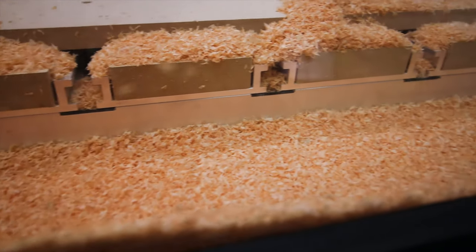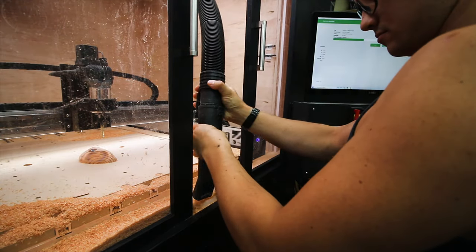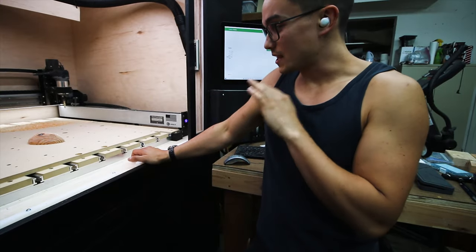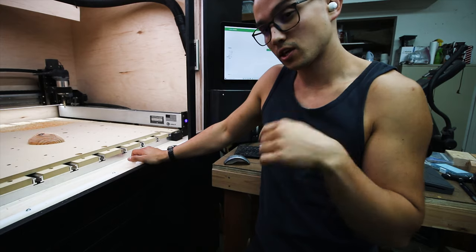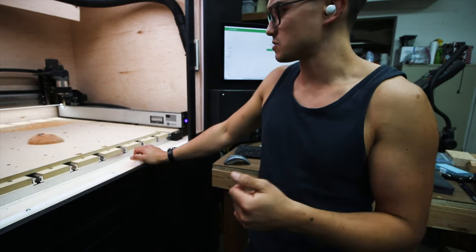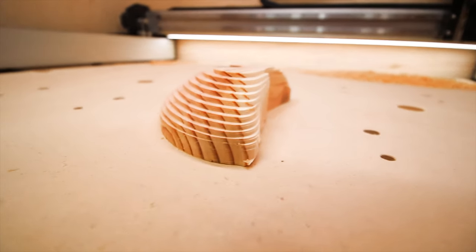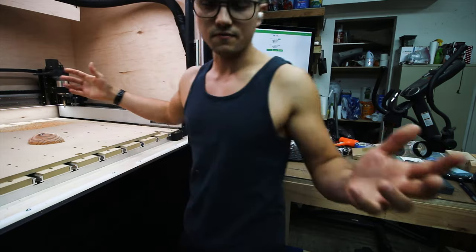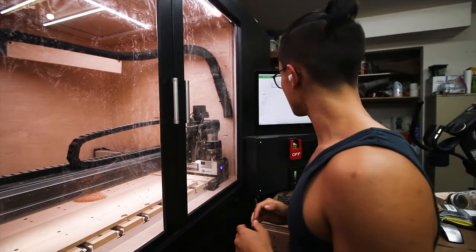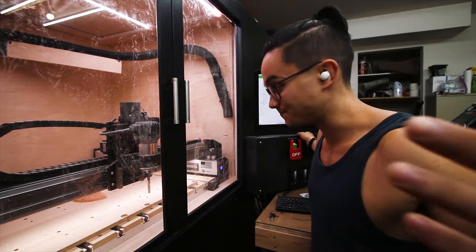One thing that's for damn sure going to be tricky with this production run is dust collection — this is already insane. Because I don't really feel like taking this whole thing off and redoing my zero, I think I can still salvage this part. I'm going to modify the contour path so that instead of it being a single contour pass, it does it in maybe three step-overs and also slow it down a bit, so that the end mill doesn't get a chance to bite as bad and pull into the part. Fortunately, it's only a small amount that ended up biting in, so I'm not losing too much sleep in terms of the final product if I have a couple little defects. That's how this one goes — it's going to take three passes to chase it in, which should hopefully not take as big of a bite at that center section, and then I get to do the finishing pass. Long story short, this is not going to be a production hold. I just want something to show for it, so we're going to try and send it and see what happens.